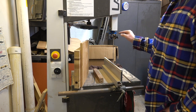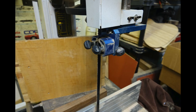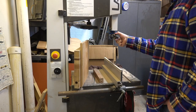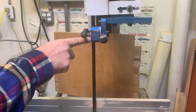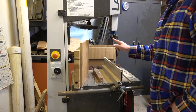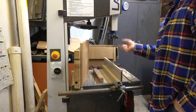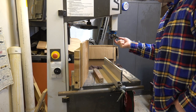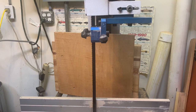The ceramic guides were new back in the day and they've worked out really well. They have become a little loose at times, and what I've done is just taken a piece of paper, stuck it in there, and it doesn't move. I've actually flipped these guides around and haven't had to reorder them. When I put on a new blade I stick a piece of paper between the guide and the blade, pull that piece of paper out, and it's perfectly centered.